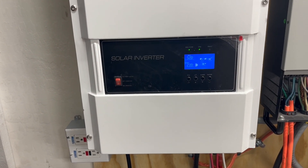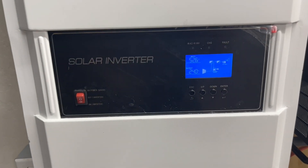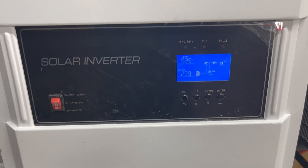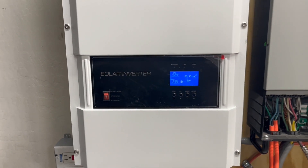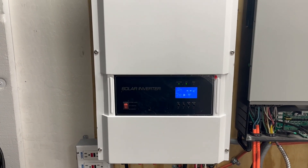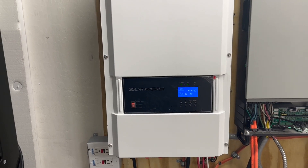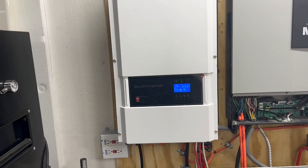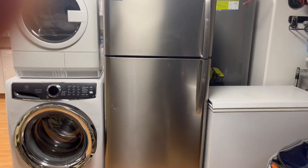This is a 12 kilowatt off-grid low frequency inverter and we only have 3,000 watts connected to it. We're running two mini splits off of that — 12,000 BTU, 120 volts. On top of that we're also running our freezer and this refrigerator freezer.